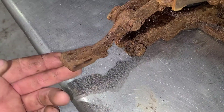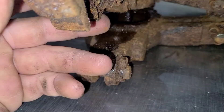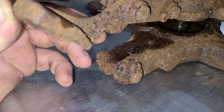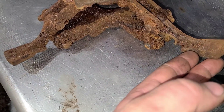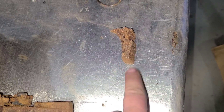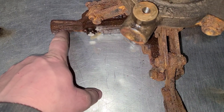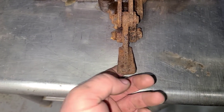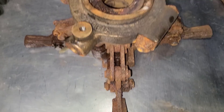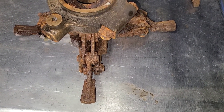Now I am starting to find some damage in here. If you look, there is half of the hole gone that should be with the rest of this part here. So along with that broken piece, we have that broken piece there and a third one, and that piece is right there. So only one of four is actually a good piece. With that being said, I'm probably going to end up finding four of these or a complete spider. I'm kind of going to leave this as an assembly for now. We'll see what I come up with.